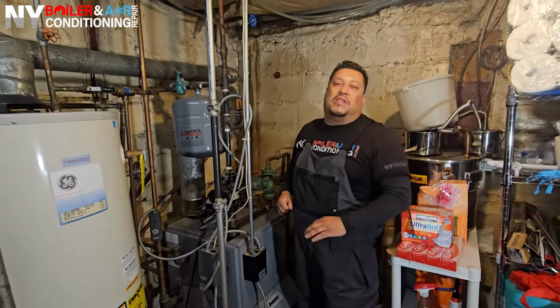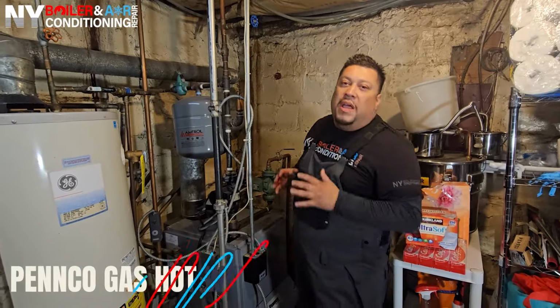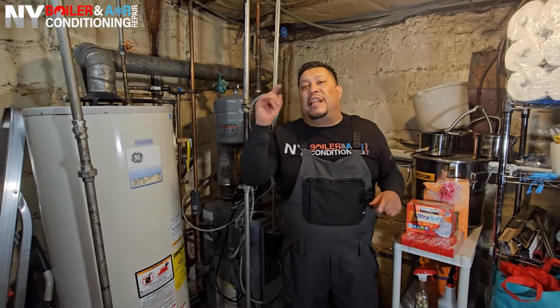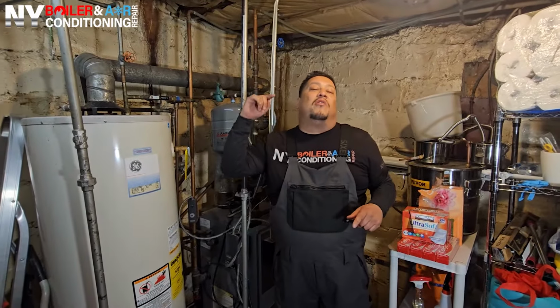Specifically, Elmhurst, Queens. So, guys, we're working on a Pennco gas hot water boiler, as you guys can see. The call came in as, Louie, we got no heat. However, there's heat in the basement, but there's no heat on the first or second floor.